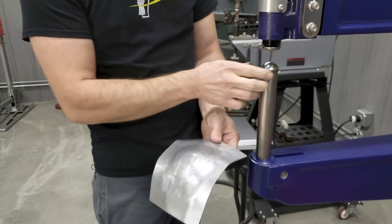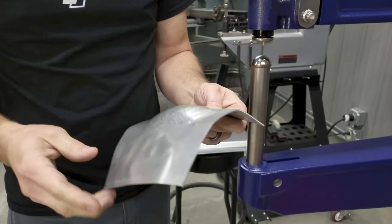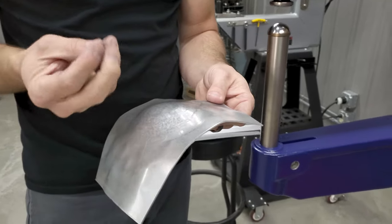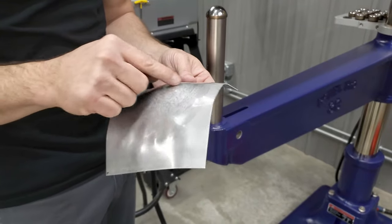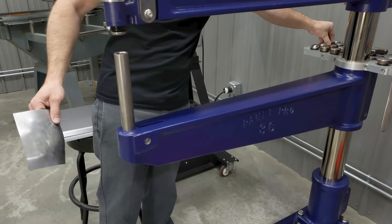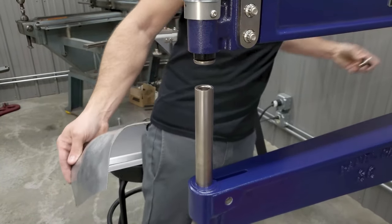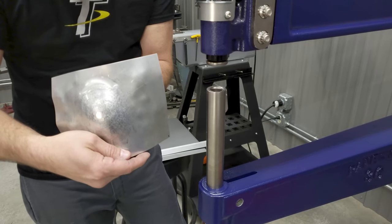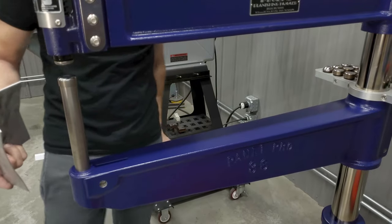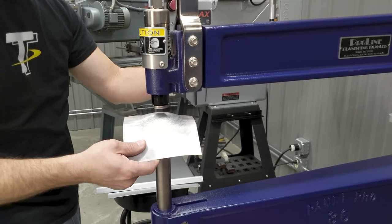You can see that with a way tighter radius on the lower die, it's putting some aggressive shape in this part — really creating a lot more of a blister. It's not as smooth because each time this is hitting it's a smaller contact area. If I wanted to smooth that area out, I just find a lower die that closely matches that little blister we just put in there. What I was just using to create that shape was a 0.78-inch radius lower die, so I'm going to go with a 2-inch radius lower die and try to smooth this up.